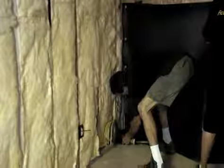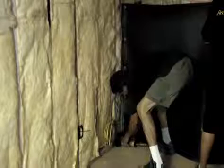If you're using screws, be sure to use a screw with a large head or a washer attached. If you use nails, again, use a large washer to help dissipate the weight of the Acoustiblok material.